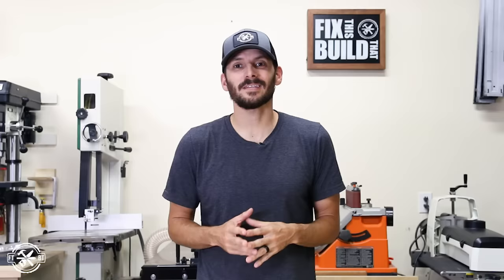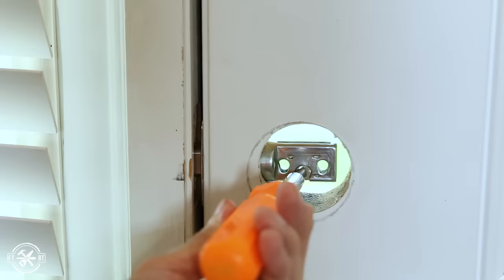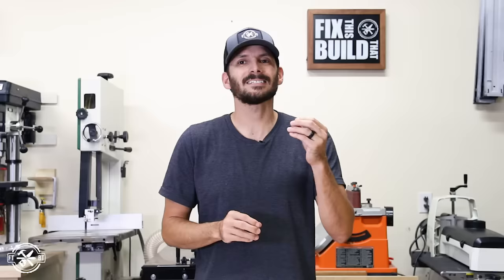Now let's get into the top five questions. I put out on social media that I was going to be doing this install and asked folks what they wanted to hear about. The first one was battery life — I got a ton of questions about how long it lasts and when I'd have to replace the batteries. The manual says about 12 months, but reviews online showed anywhere from 9 to 15 months. The biggest thing that drains your battery quickly is if the lock is not fitting properly — make sure it is not scraping the side because that will drain your battery much, much faster.